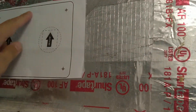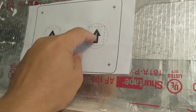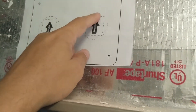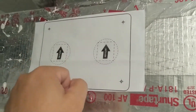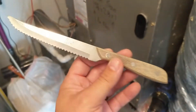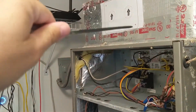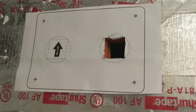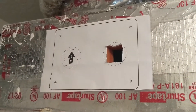We mounted our cut template up. Don't worry about doing the screw holes. You see it's a circle or a square — you can do either one. Circles you have the drill bit. Square is if you want to use — and I'll show you a very advanced tool for doing this — a steak knife. Here's our advanced tool: Kitchen Delight, made in Japan, full tang stainless steel steak knife. All we're going to do is punch it in and cut the square out. The insulation isn't really that thick — it's very soft, and a steak knife works fantastically for this.